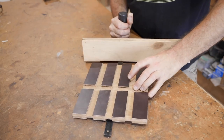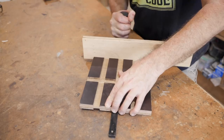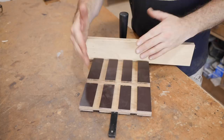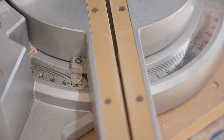To use the jig, you put it on top of the mitre gauge bar, slide it up to the fence and lock that in, and now we know that's set at 90 degrees — it's quick and it's accurate. Next we'll cut off a couple of the corners at different angles, and that will allow us to make another three commonly used angles.